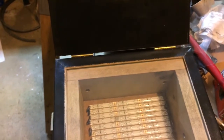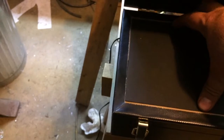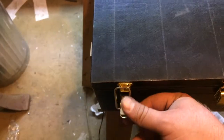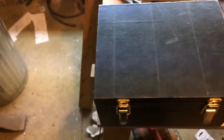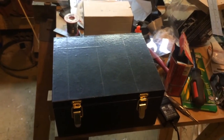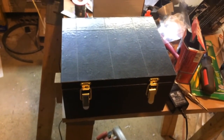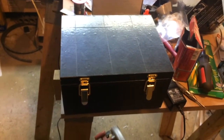As I mentioned, I did buy some PCB photoresist film specifically for that application, not really knowing if it would work, but suspecting that it possibly wouldn't. What's unique about knife making or steel etching stencils is that it is a photoresist film that you develop and remove the negative part of the film. But inside that, there's actually a mesh or a screen that holds the integrity of the stencil or the film together, so that if you're doing letters and such, the inside circles and inside curves aren't going to come apart or fall out on you, if that makes sense.